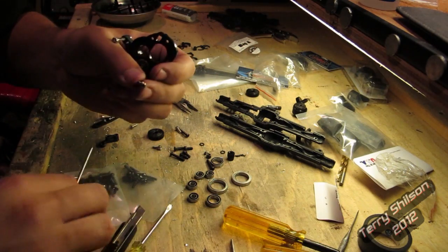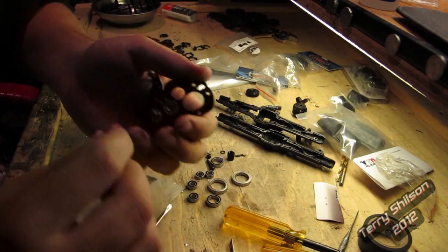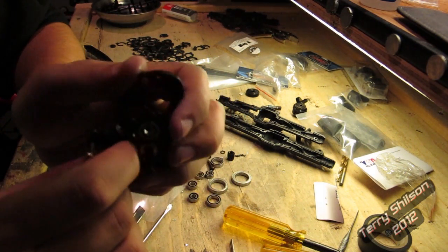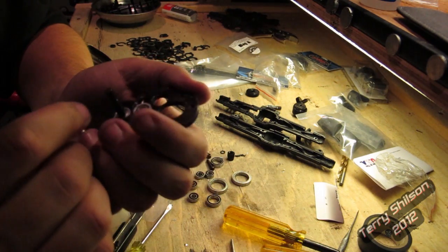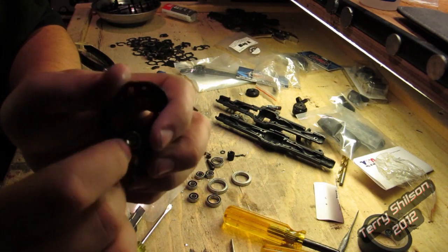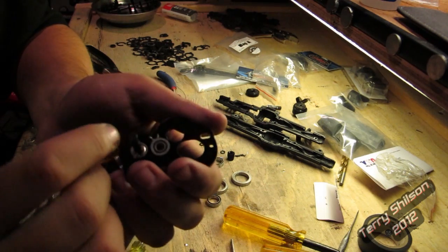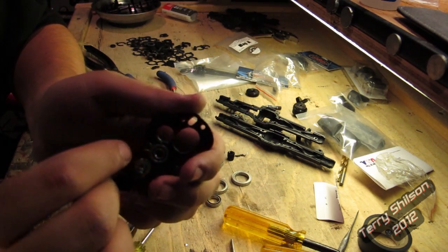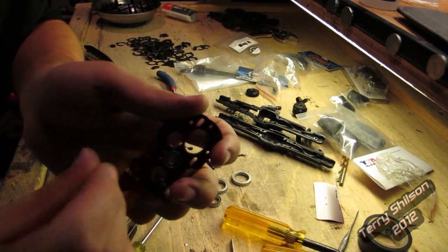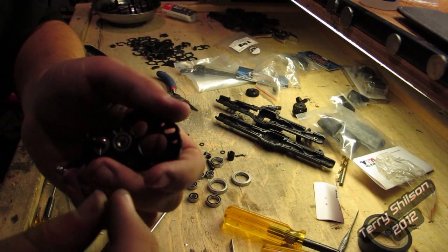So one of the things I didn't consider when I was putting this screw in, and I ended up stripping the screw, is this bearing. Because it's flanged, it sits just higher than the plate and just higher than the little area that stands up a little bit for the screw so that it will clear that bearing, but that bearing just barely is above it, so it caught the edge that I had shaved off and ended up rounding out the screw.